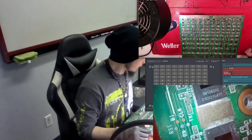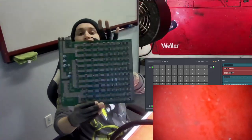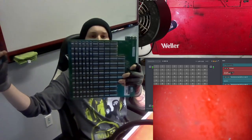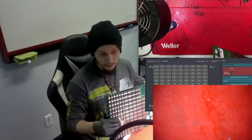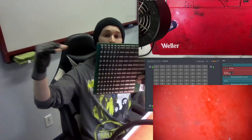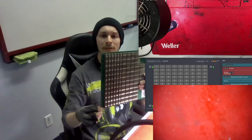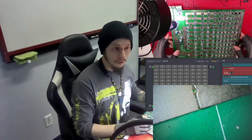This is a J, and we've encountered this issue with J Pro, S19, S19 Pro, L7, and all other models that resemble this. If we take a closer look with the heat sinks, the air goes through here and out the other side. On many models we've seen that in this corner, this corner, and even sometimes right in the middle, all the traces were either corroded or completely gone.